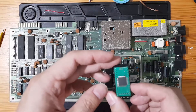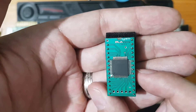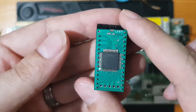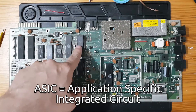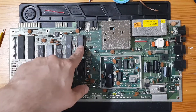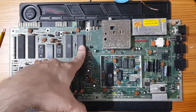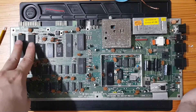I've got here the replacement PLA. This is a very special PLA replacement called Plankton, and it's basically an ASIC chip that replaces the functionality of the PLA — the programmable logic array. Normally in the Commodore 64 this is the thing that goes and causes black screens, so we're going to see if this is the cause of the fault.